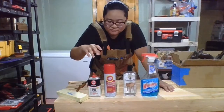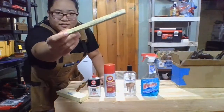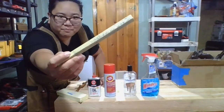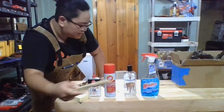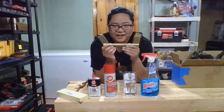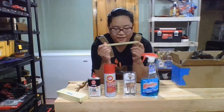These get clogged up pretty easily. They make great swarf, but the metal pieces and dirt get stuck and kind of linger. Basically what happens is that it actually decreases how much cutting power your stone has if you can't get all the dirt out.